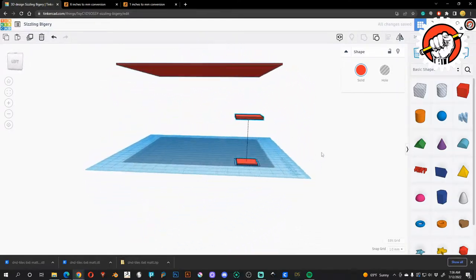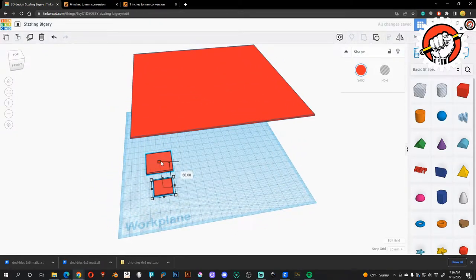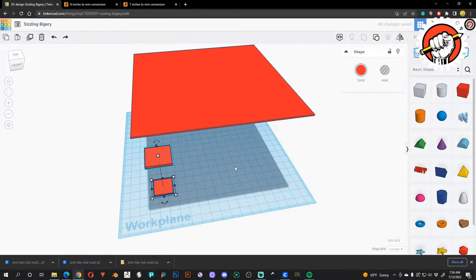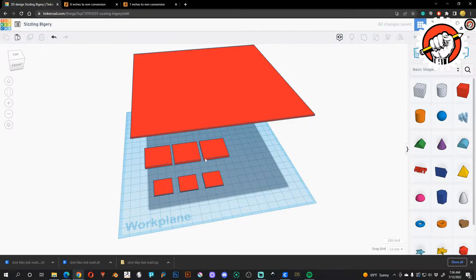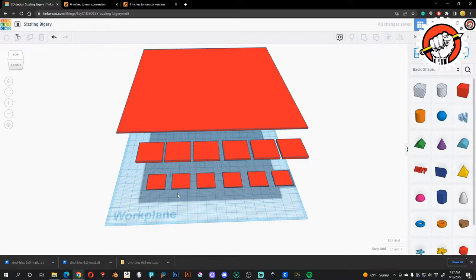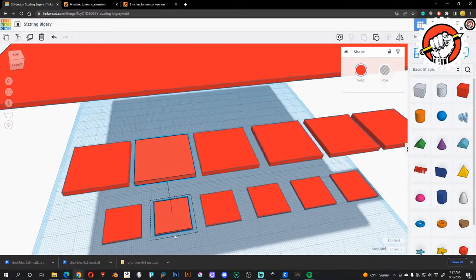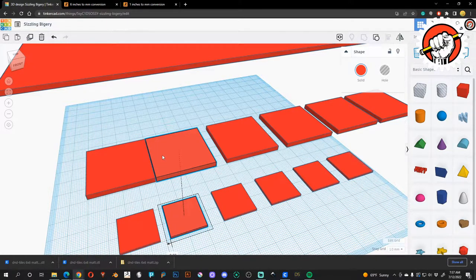Even though they're floating in the plane, I want them all linked for what I'm going to be doing. Now we're going to copy and paste, slide this guy over. I'm not too worried about the spacing right now — the only thing I'm concerned about is getting six of these on the board. Since they're 25 millimeters, I'll fudge the numbers just a hair and slide them to keep around a one millimeter width of distance between each.